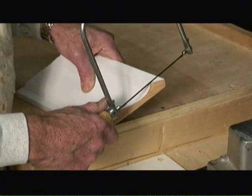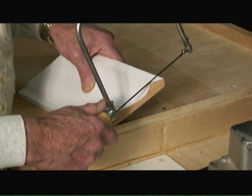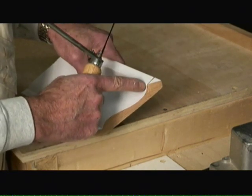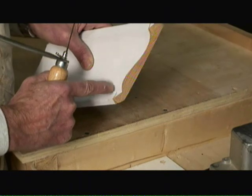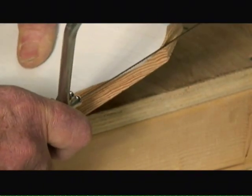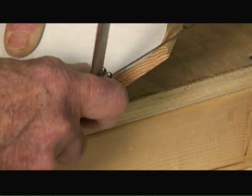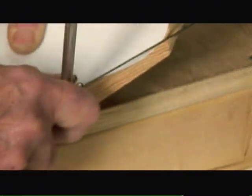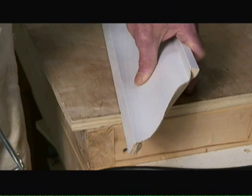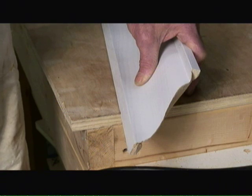To make your coping cuts, you take one of the sections of board that's been cut at a 45-degree angle, and at the bottom and the top you cut a straight perpendicular line to the relief points — first at the top and then at the bottom of the crown molding. Once we've removed both the top and the bottom wedges, we then take our coping saw and cut along the paint line at a 45-degree angle to basically back-cut the crown molding material. Once we've cut the backside of the 45-degree angle board, we now have our coped edge, which can be used to form our inside corner seam.